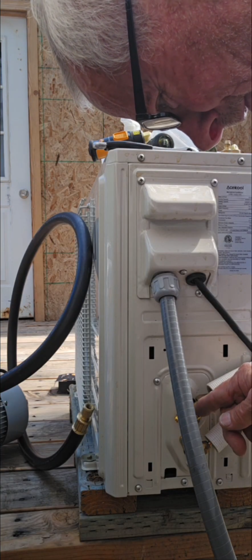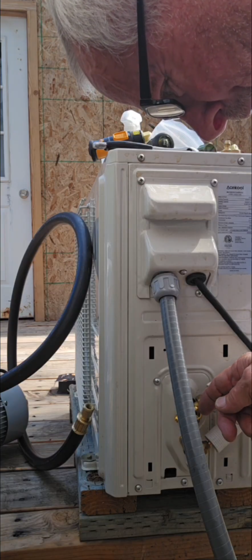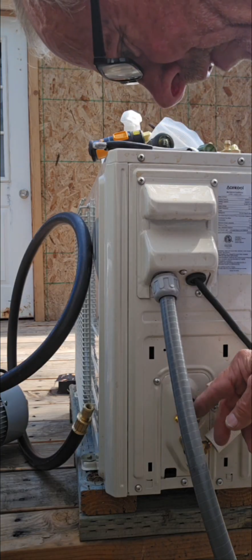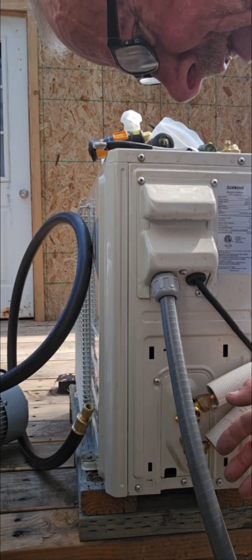This is not much of a flare face. So you put it on the threads too. Put it on the face, but put it on the threads too. These things are not decorative. These are for the sealing, so it helps to seal.